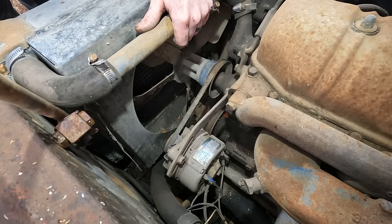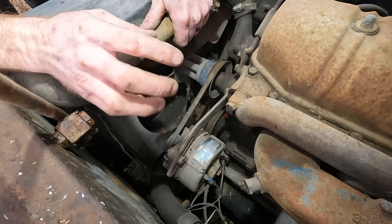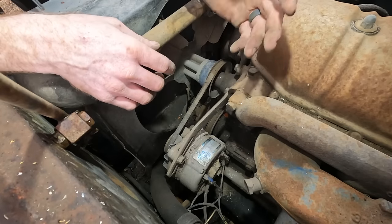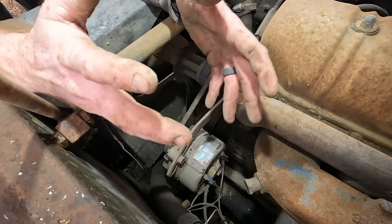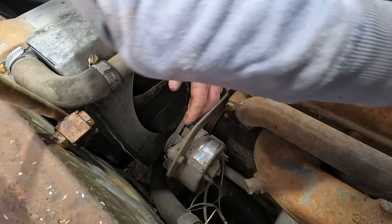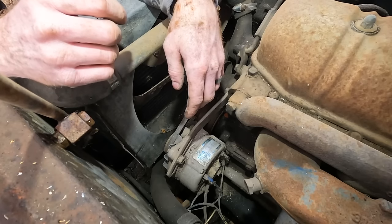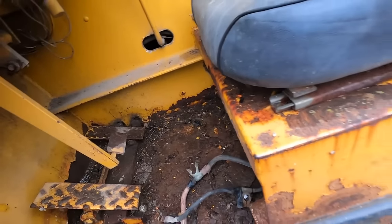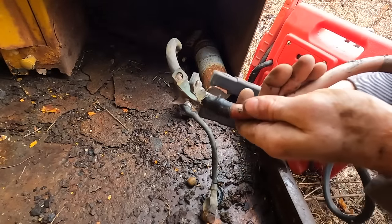It moved a little bit, so I don't know how stuck that means it is or isn't, but I want to just put a battery on it and we'll see what happens. Usually if you can get a diesel that's been sitting just moving, and it's not completely stuck, then you have less of an issue of damaging it too bad. I don't want to run it long with the oil that's in it, especially if it's got water in it. I don't know if that's water from outside or from ahead, but I'm betting it's water from outside just due to the way that the intake and exhaust are set up. So, yeah. I don't think there's any chance this thing is a 24-volt system. I don't know if these batteries are going to be any good either, or battery leads.